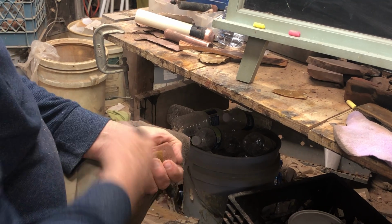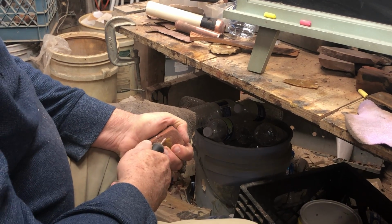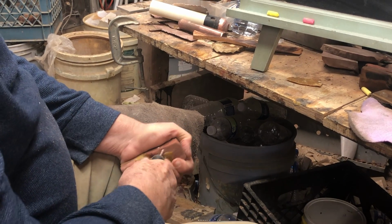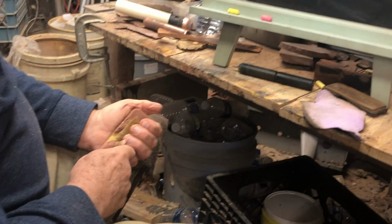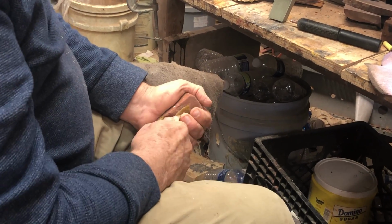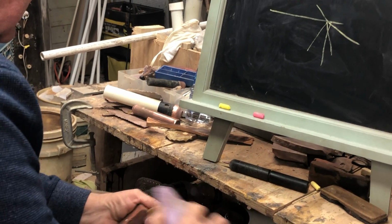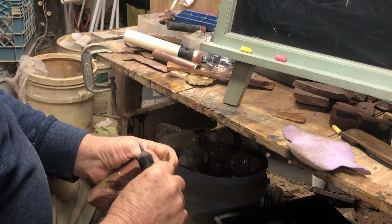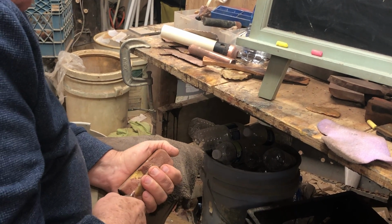We'll come here. I'm going straight across. You can even actually put it on top and just shove it like that. I like to angle it like this. Just put it on there and shove across and break that edge off. Some people have a piece of hollow copper. Watch me knock my board over. I take a hollow copper tubing, beat it flat, and stick it right there, and I just roll it all the way down. That'll turn the edge real quick. You see how that edge is going this way? That'll turn it real quick. Now, there's a couple spots here I didn't hit with the copper. Need to turn it a little better.